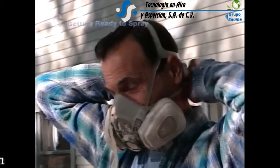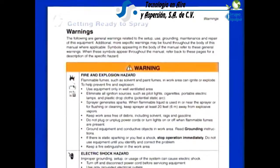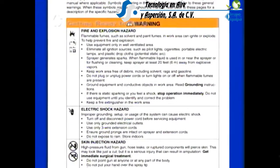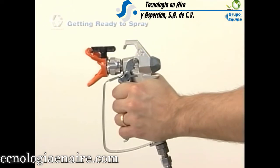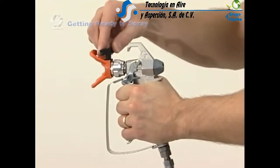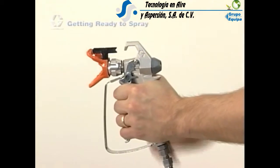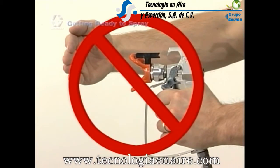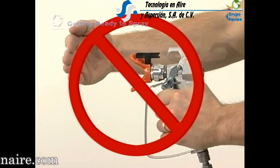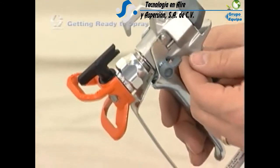The last step — safety — is one of the most important preparation steps. For your safety, read the operating manual and review all safety precautions for your paint sprayer and the materials you are spraying. Use your equipment only in a well-ventilated area. You never want to squeeze the gun trigger when the spray tip is between the spray and unclogged positions. The tip should be secure and completely inserted in the guard housing and pointing forward. Never put your hand in front of the tip and never point the spray gun at yourself or anyone else. High pressure fluid can pierce the skin and cause a very serious injury. If this happens, seek immediate medical attention, even if the injury is small. Injection injuries are very serious.